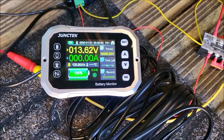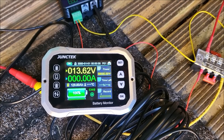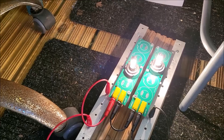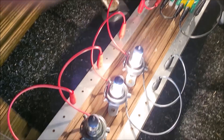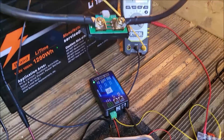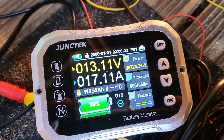I'm now set up for doing a full discharge of the Li-Time battery. I've got my monitor battery set to 100% — I've called it 120 amp hours so that we can see what capacity there is over 100 amp hours. Let's start the discharge by connecting bulbs. I've got a few extra bulbs this time — a couple of H7s. Let's plug in the H4s.